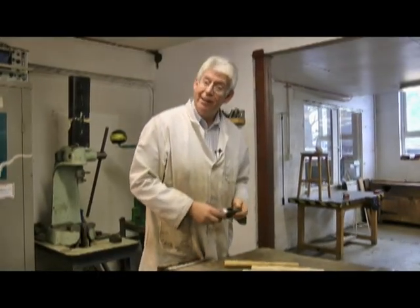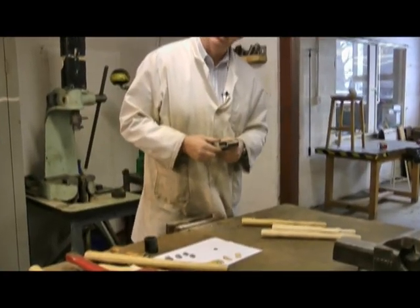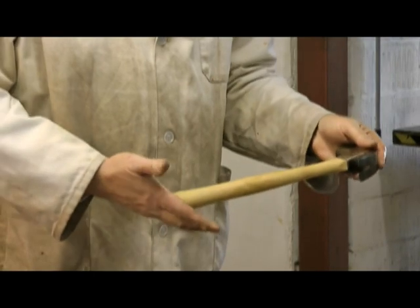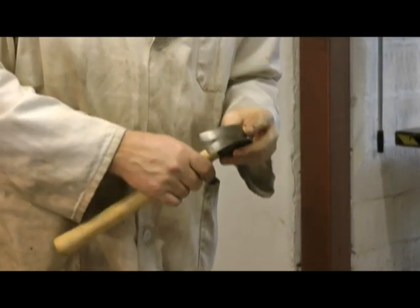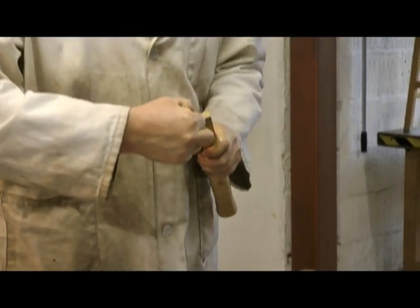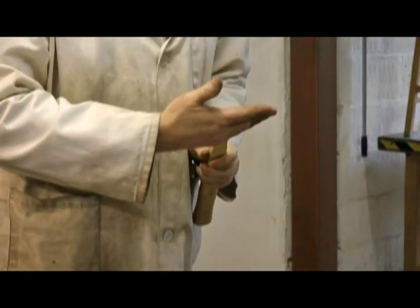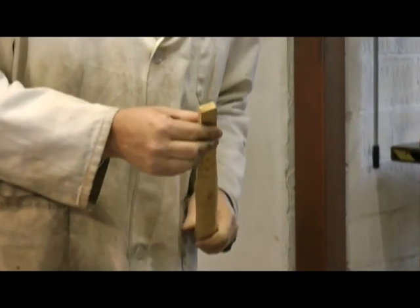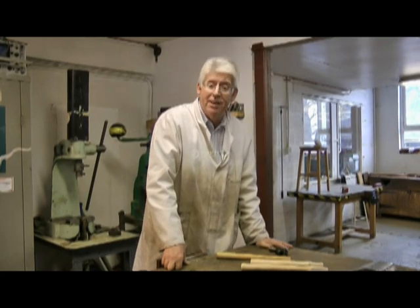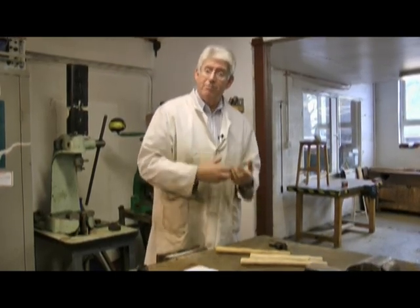When it comes to adze-eye hammer heads, mainly for claw hammers with a rectangular head, there's a slight difference - the handles already have a rectangular shape to them. Everything carries on much the same as for the ball-pane hammer, except when you put the wedge in you do the cut diagonally from corner to corner. Nobody's quite sure why, but this is the recommended method and you do find new hammers from manufacturers done that way. The method really is the same for all sorts of hammers - lump hammers, sledge hammers, even axes and hatchets - all follow the same pattern to make sure it's wedged in two directions and is firm and safe to use.